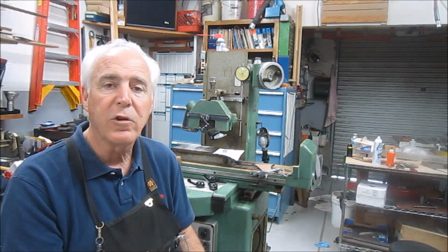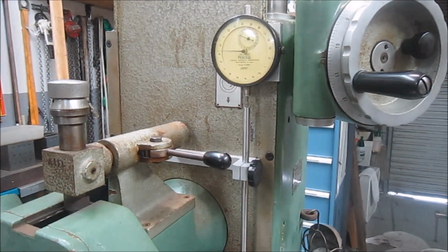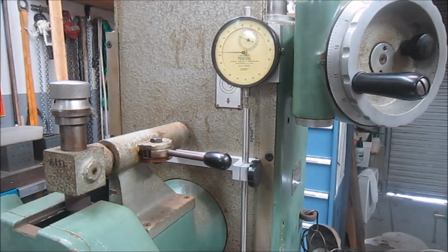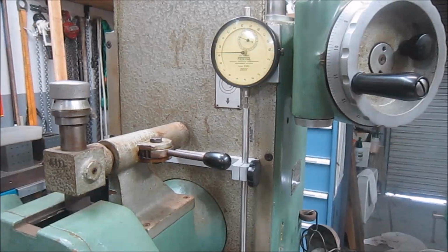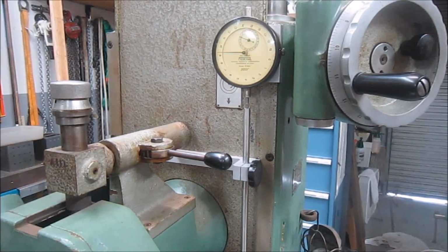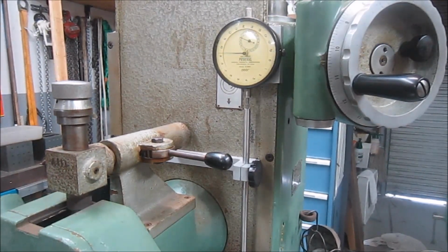First we'll talk about an addition that I did on it. Let me move the camera, and a couple of additions actually, and we'll go over some items. Okay, first item that you can see here, as we talked about in the last video: this unit is millimeters, and so each tick line on this dial is equal to 0.004 millimeters, or basically 1.5 tenths of feed. The complete dial, if you turn it 360 degrees, is about 24 thousandths drop.